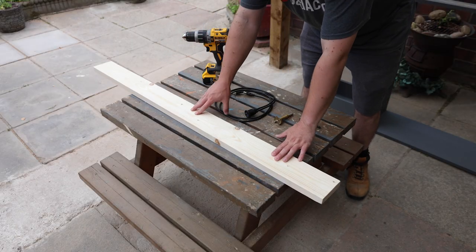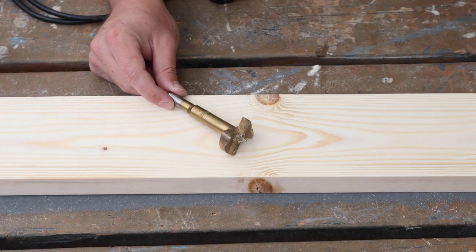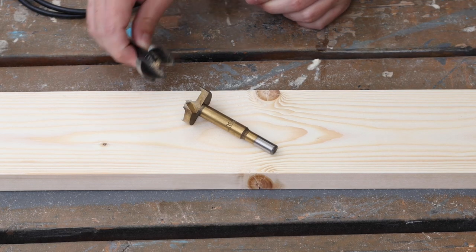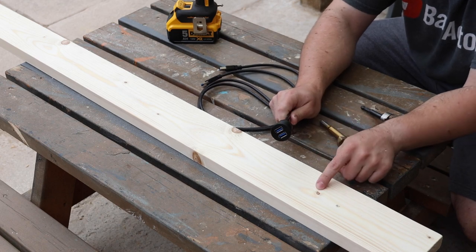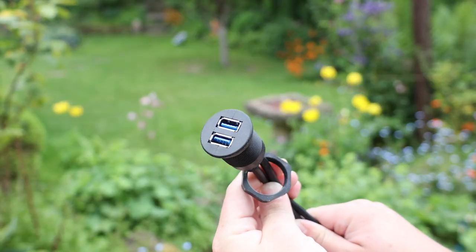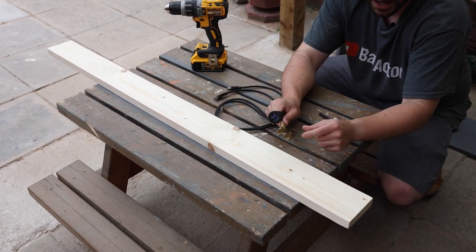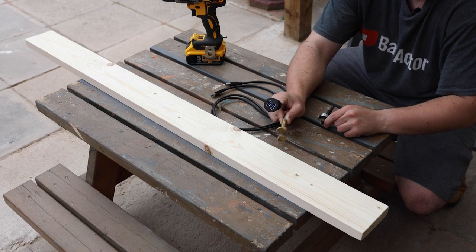The shelf's cut to size, but before I put any wax stain on it I first need to drill a hole through — but it's going to be a little bit different. I'm first going to start with the 35mm drill bit and go down just over halfway through the top shelf board, then switch over to a 30mm drill bit and continue the hole all the way through. The reason for this is I'm adding a USB hub to the top of the shelf. The hub fits through the 30mm hole perfectly but doesn't leave any room to attach the nut on the other side, which is why I need the slightly bigger recess. We drill the bigger hole first because this drill bit leaves a nice centre point ready for the smaller drill bit to carry on — if you started with the smaller bit it's really difficult to start the bigger one afterwards.